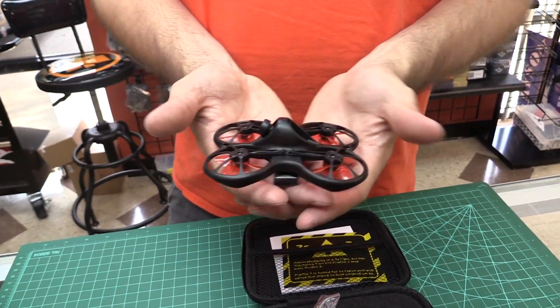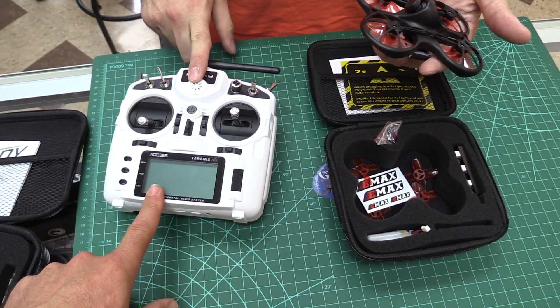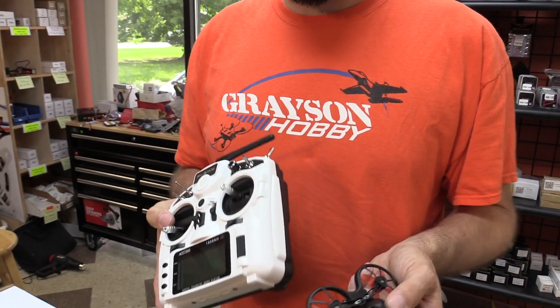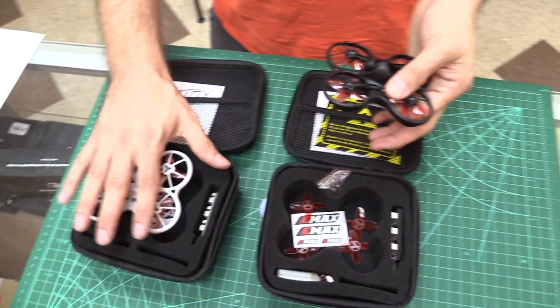The flight controller on this one is really cool — the original TinyHawk was only D8 mode. The newer radios from FrSky, like the X9 Lite, do not support D8 mode, which would render this quad useless. However, it does have D16 mode capability. This is one of those integrated receivers, and a lot of people have noted dropouts in various other models running the D16 capable mode. If you have the ability to run D8, absolutely run D8 — it's probably recommended. But don't hesitate to try D16. If all you have is the X9 Lite, just run it with telemetry off in D16 mode.